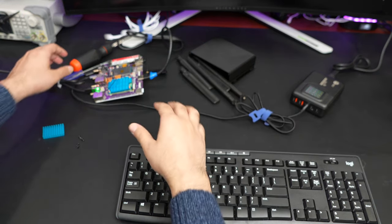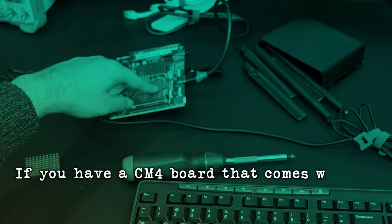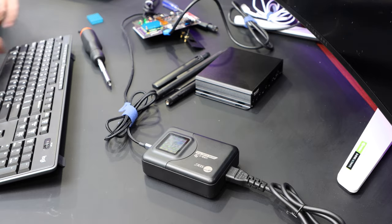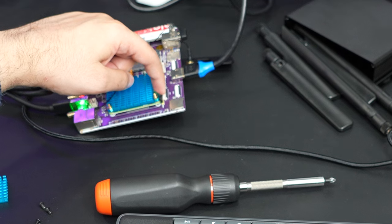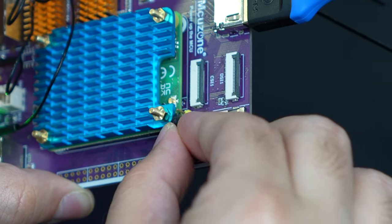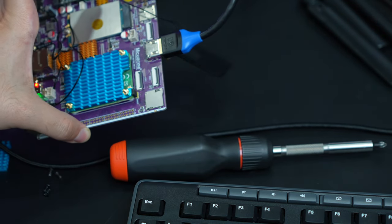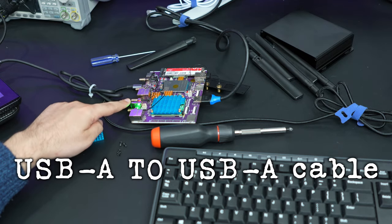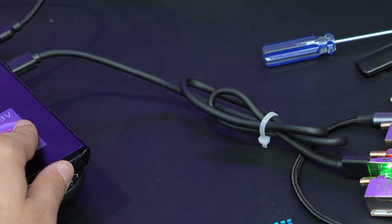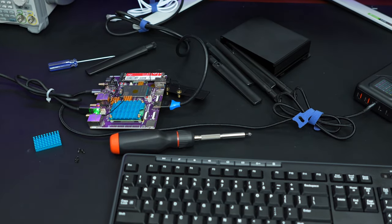So - an important step before installing the OS. If you have a CM4 board with eMMC storage, you won't be able to use the SD card slot - it doesn't boot from it. There's a jumper right here next to where you install the CM4 board. It came with one pin sticking out, so you have to remove that jumper and connect the two pins together. Then you need a USB-A to USB-A cable - or USB-C on your laptop to USB-A on this board - connected to the OTG port.